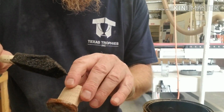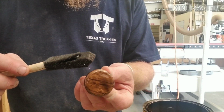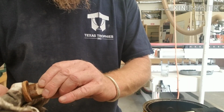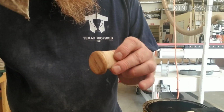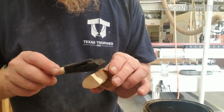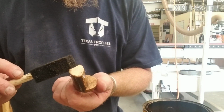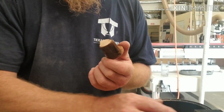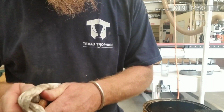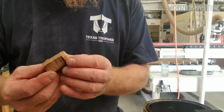Like so. This is red oak, and we put walnut stain on it. So that's just one of our standards, I guess. I don't know if I've ever seen a red oak stain, but I've never really looked for a red oak stain, so I couldn't tell you the truth right there. I'm just gonna tell you this is the best stain for red oak. Yeah, whatever. You can put whatever you want on it. But for this application, we are using the Special Walnut 224 Minwax. And that's just what we've done forever.